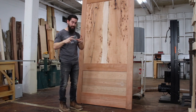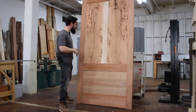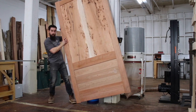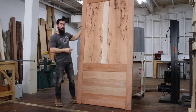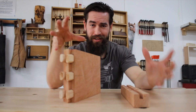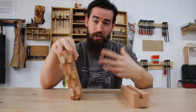That should be loads of glue surface in combination with the stub tenon to create a really strong and rigid door. I know this because the door is dry-fit right now with no glue, and there is zero racking on it. Currently that is nothing but the mechanical advantage of a series of small tenons.